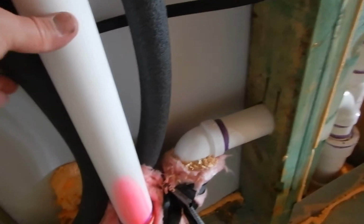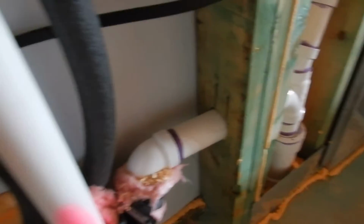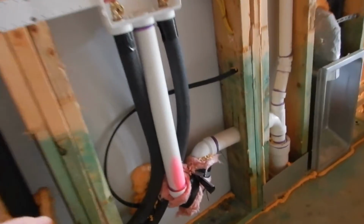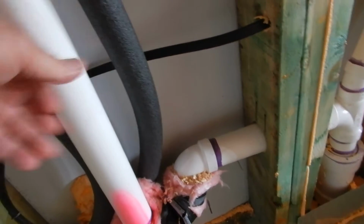Moving into the laundry. The laundry box is labeled. That's a good thing. But over here, this is not a nailing pattern. Alright? But this is, see the way the drain is coming out and it's almost flush? If it's not flush with the drywall, as it expands and contracts, it's going to make noise. If that's touching the drywall, when the water comes in, it's going to be like a magnifying amplifier, and it's going to be louder. So I get that. That's just a little tight. Just put it out here. I think that's awful close to the drywall. I just do.